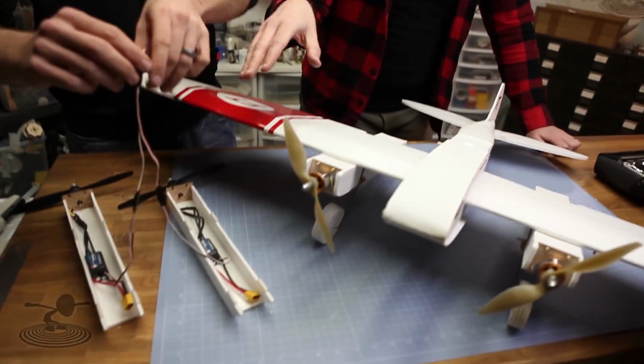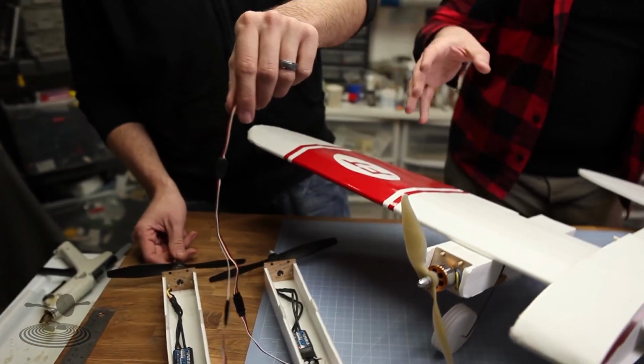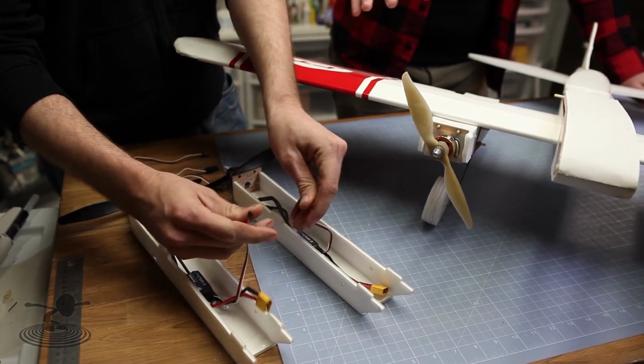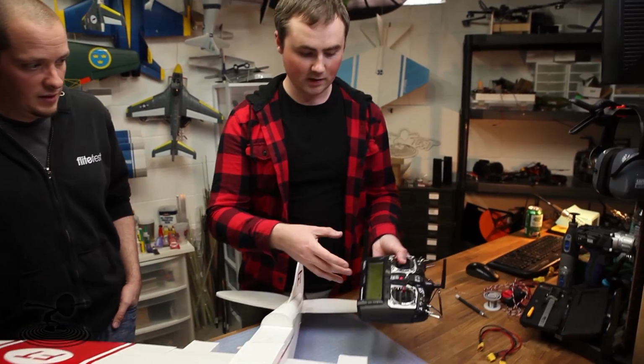No mods. Usually it's plugged in using a wire harness to your throttle channel. But in this case, you unplug that and plug them into separate channels. In my case, I use channel 3 and channel 6. That's 3 on Futaba and 1 on Spektrum. So you just plug it into an auxiliary channel normally. I'm using the HiTec Aurora. You need a programmable transmitter, and every transmitter is a little bit different. For the DX8, we may even be able to make a file that they can download.